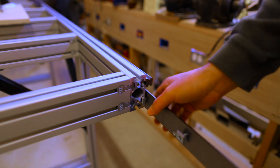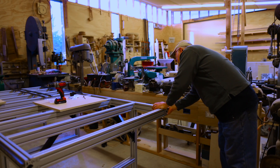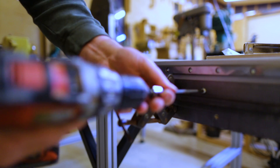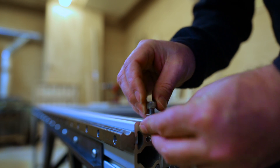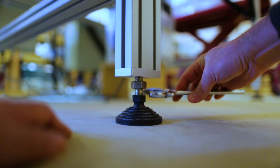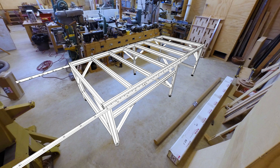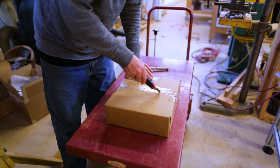Once the rails are in place, I put the rack for the rack and pinion in place — same idea, sliding the racks onto the sides and tightening the bolts. The rack comes in two pieces, so I used the rack from the gantry to line up the two pieces along the Y-axis. I also checked the table to make sure it was planar, adjusting the feet until two strings in the middle just touched, confirming the table is flat.